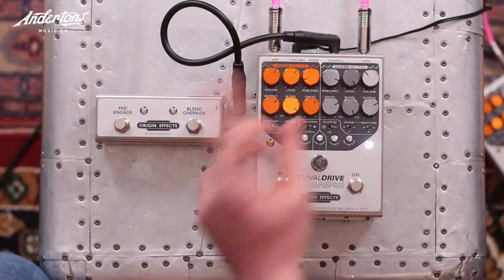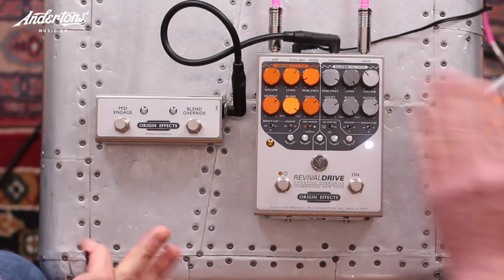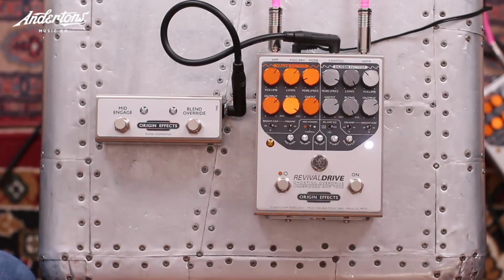Okay, so essentially what you've got is two blocks of, if we just take the main knobs, two lots of the same thing. The difference is that this one's modelled after an amplifier with a silicon rectifier, and this one's modelled after essentially the same thing but with a valve rectifier. So we start with the silicon side. What brands would typically do that?